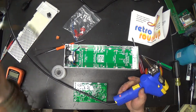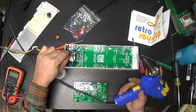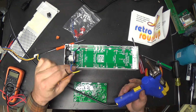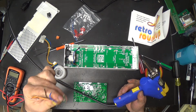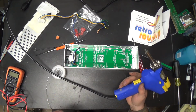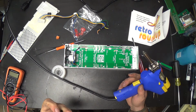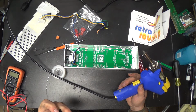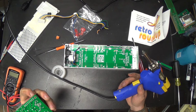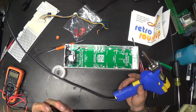I also want to solder this one straight on. So that's a gauge down. That's what, 16 maybe? I still don't know if that'll fit. Well, these great big pins here, if I desolder this great big connector and use it, I'm pretty sure it'll fit in there. So yeah, probably be easiest to solder that thing on first anyway.